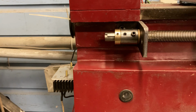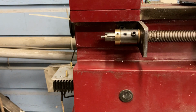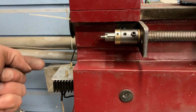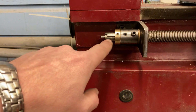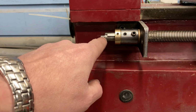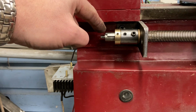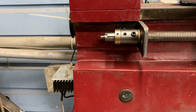All right, the next piece going into the clutch mechanism is this bearing. Like I said, this just helps support this end of the shaft to the other end of the shaft. The clutch mechanism was also designed so that it helps support the 2 shafts together. If you look at this key, there's about a 1/4 inch difference between the end of it and the end of the key. And that is so the clutch piece, the brass piece that I'm referring to as the clutch, constantly rides on the very tip of this shaft, helping tie it all together.